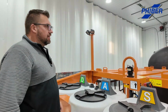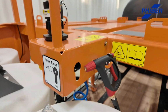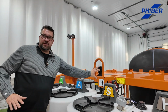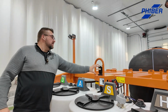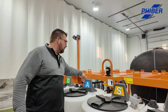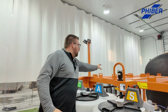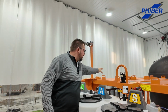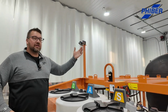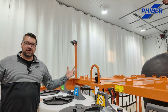It's really easy. There's a hand sprayer on all models. So if you don't like how the auto system works, there is a hand sprayer. You can deal with problem areas really easily. All the Dash 2s and larger have this hose rinse kit. So those gravity hoses that I was talking about, or hoses going from your totes down below to your chem pumps, or like from your cage tote transfer hose kits, or those kinds of things, you can take them, hook them off the inductor, plug them in, off the totes, plug them into here, and now you can circulate. Just open this up and you can circulate your cleaning agent through your tote transfer hoses and clean those. So it's just super simple to clean all your products.